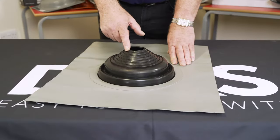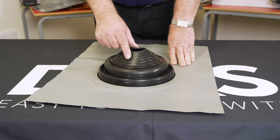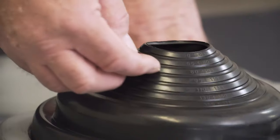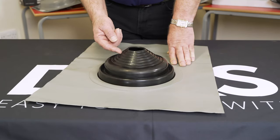There are cut marks on the cone, typically found on most Dektites. It gives you the size range of the pipe in both millimetres and inches, and you cut the groove that corresponds to the arrow for the pipe size that you want.